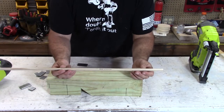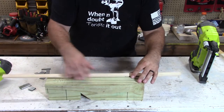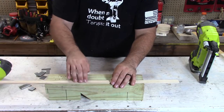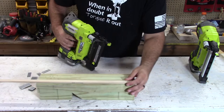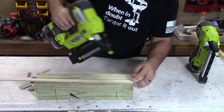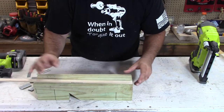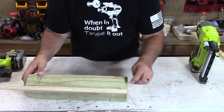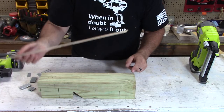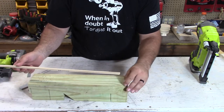Okay, so we have a quarter-inch piece of trim right here. This is a four-by-four piece of pressure-treated wood and they're both pine. First, we're going to shoot the brad nailer in here. So that sunk it in and it did a pretty good job — you can't really see it, it's pretty well hidden. Here's the problem: it pulls straight out. Look at that, there's no issue pulling that straight out.